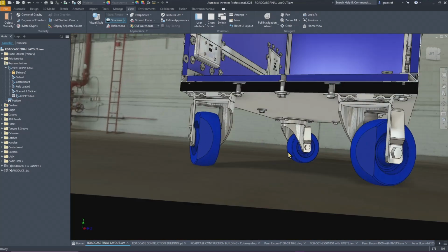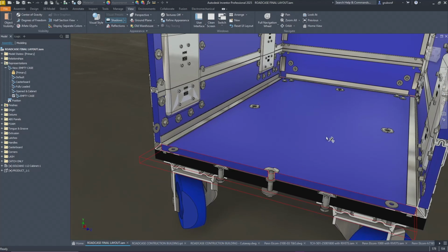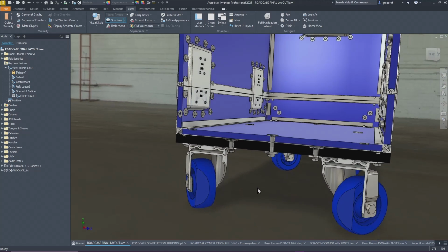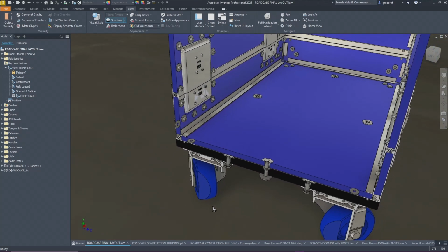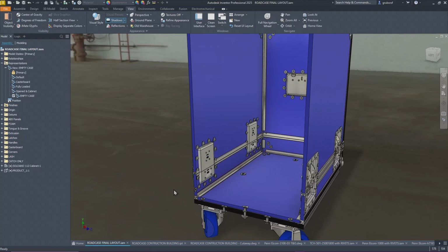Also, this has a caster board that's detachable. It's only 4 bolts. So that means the T-nuts that have to be used in the bottom portion have to be put in prior to the foam. If you don't put these in, you're either going to be punching through the foam and kicking yourself because it's a mess, or you're going to rip out the foam to put these in. Just think ahead, plan ahead exactly how you're going to assemble this. Get all your parts, lay them all out, and then make sure you're following the right procedures.